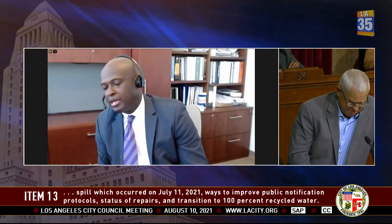We essentially used bleach and water for cleaning inside the buildings. And from time to time, we used deodorizers within the plant. We've posted that information on the website and also shared it with AQMD. If you look at the AQMD monitoring data, it does coincide with the fact that there are no elevated levels of methane or any kind of toxic pollutants in the air. Hydrogen sulfide is the one that is registered in terms of odors, and especially within the past few days, that number has gone down to single digits. The state limit for hydrogen sulfide is 30 parts per billion for a 1 hour exposure. Even though our readings are instantaneous, they are now in the single digits.